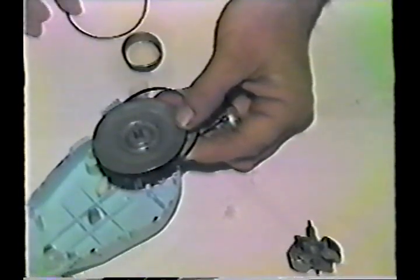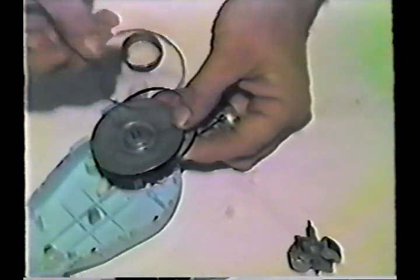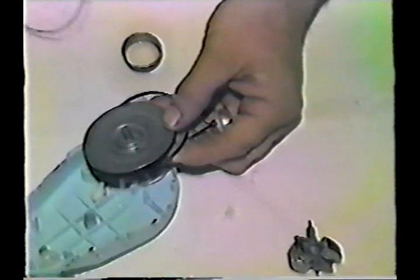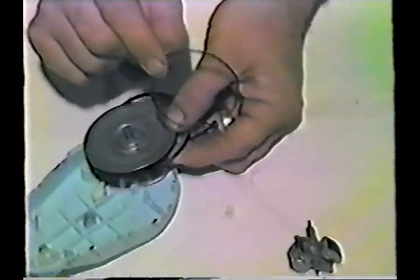Okay, in the front of this video, I showed you the O-ring, but I didn't mention what type or size they are. The type that we use, the manufacturer's name is Stillman. The part number is A036. The compound is 310-70. This information is very important, since you'll have to go to an O-ring distributor in your area to get these. You can look in the yellow pages, and they're usually listed there under seals or O-rings.